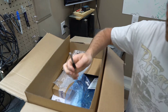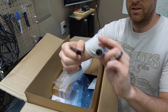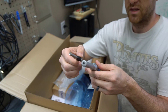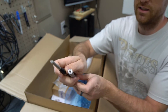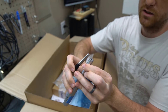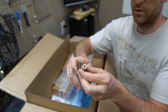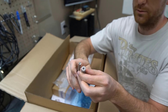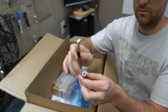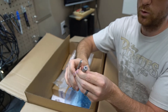This is the microphone sent to me, and then this is what most people regularly use - an XLR ECM-8000 made by Behringer. You can see how small the electret is - the electret is the portion on the end that actually does the capturing. Ideally the smaller this is the better, because like a transducer it will have a polar pattern of its own and have breakup of its own. The smaller the electret, the further off-axis the polar response will remain flat, and that's a good thing.